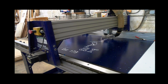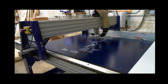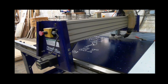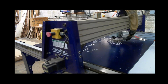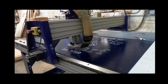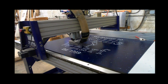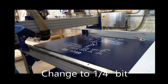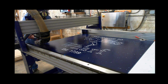Then I created a file in V-Carve and cut everything out as a shallow pocket. The idea was the white PVC would show through — no painting needed. It's sort of like homemade color-core: the blue is the sign field and the white is pocketed out. Not only is it easy to cut without intricate painting inside the details and lettering, but if you need to touch it up you can just take a foam brush with that same paint and brush to the edge. It cleans up really nicely with a sharp shoulder between the pocket cut and the blue field.